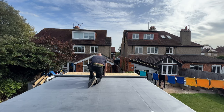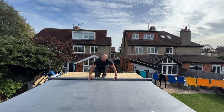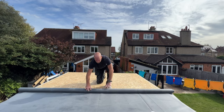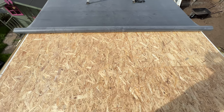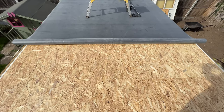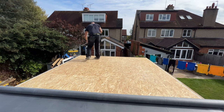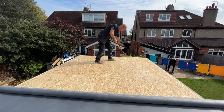Now we're on to the second half of the roof — same procedure. Just bring that roll back right to the centre and then you should feel a bit of resistance when it comes to where you first stuck it, where the adhesive is stuck to the rubber. Go ahead and give it a good sweep down. Make sure there's no grit or anything on the roof — you do not want anything getting under that because it will just show through. So get it as smooth as you can.